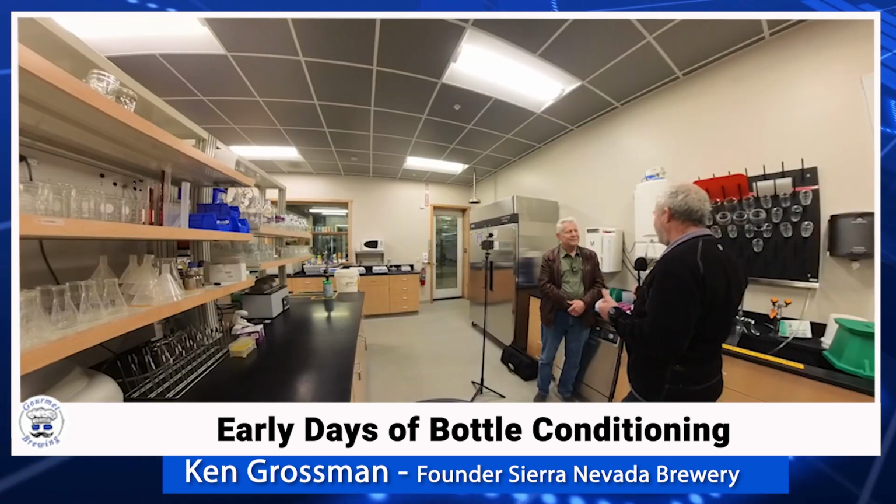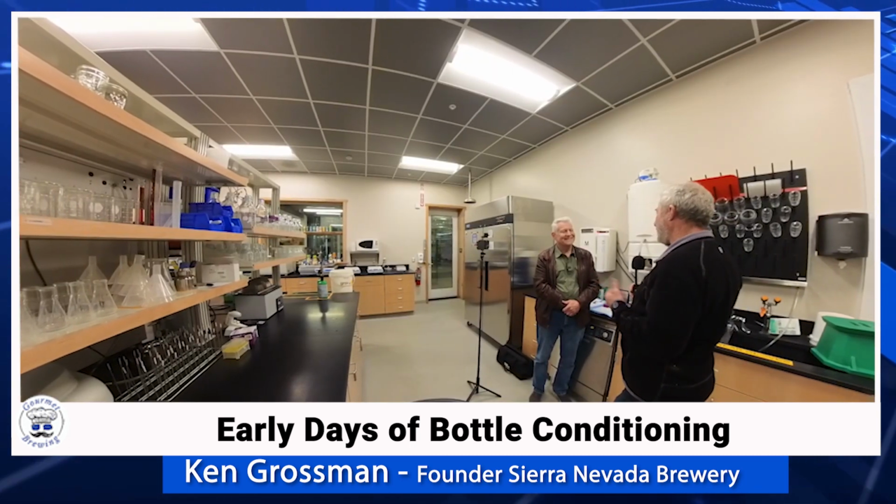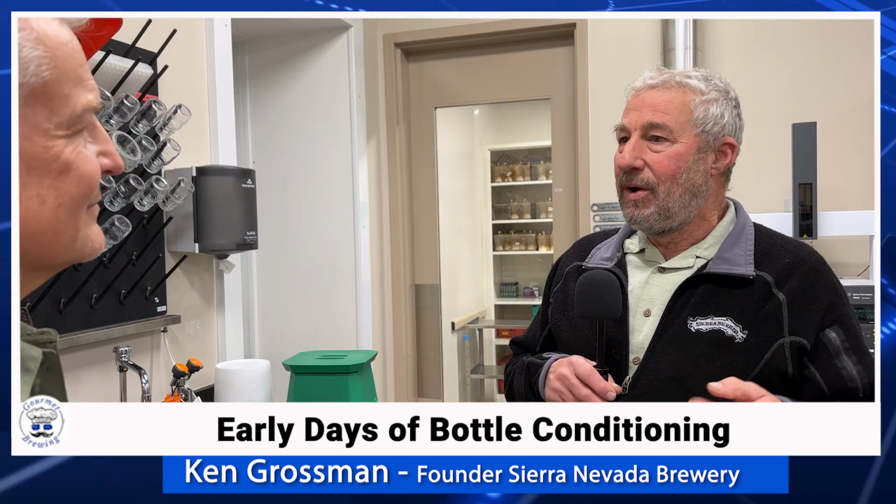Yeah, it is. Going back to our early Davis consulting years, one of the grad students said, you're going to have to bottle condition. You've got nothing else you can do. We knew that. So we started out as a home brewer would, putting fermentable extract and yeast in the bottle. Initially, we didn't have a really great way to control how many cells we were putting in our finished beer. We had no filtration, no clarification step. So we would rack our beer out of a storage tank.